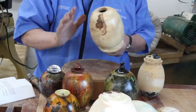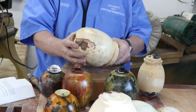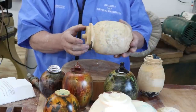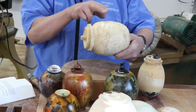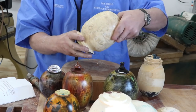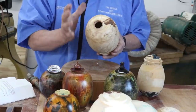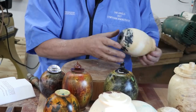It's rough turned. I rough turn everything anymore, and I need to put this back on the lathe and true it up. So that's kind of the next step. The tenon really is quite large. I don't need that big of a tenon on there. So what I may do is reduce the size of that. That will complement the final shape as I go into that tenon spigot area. Okay. I can put that between centers. I can put it in a scroll chuck.